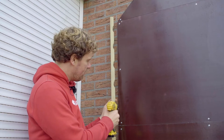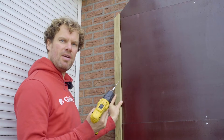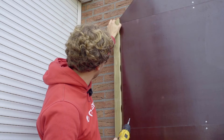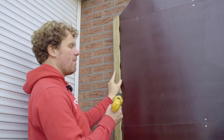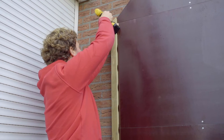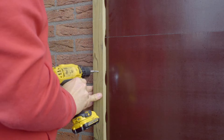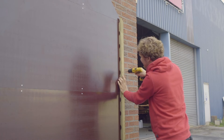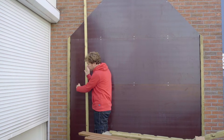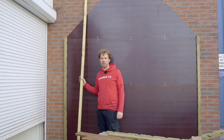If you're using special facade battens, make sure the arches face inwards towards the facade. We're using stainless steel screws around 4 by 50 millimeters installed every 30 centimeters. There's no need to pre-drill. Make sure the sides line up. We recommend a center-to-center distance of 40 centimeters between the battens, but measure the surface first, because you want the battens to be at approximately equal distances.